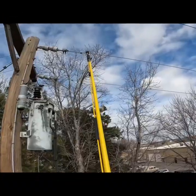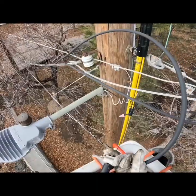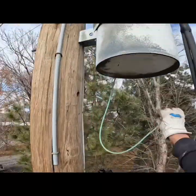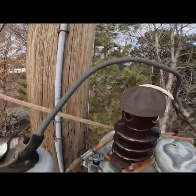What's up guys? Today we're gonna be doing a three-phase overhead transformer bank. It's a 12,470 primary side and 120-208 on the secondary side. There's an existing transformer up there right now, so I'm gonna go ahead and isolate this transformer by getting rid of those little one-bolt connections and then drop out that triplex and get rid of it entirely.